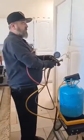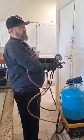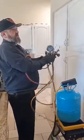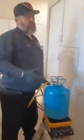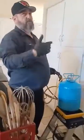And you're done? Pretty much just got to button it up, put seals on the valves that you've just installed, screw in the back panel. And seals like this one? Yes, just like that. You want to cap it off because these are access valves like on a tire. So sometimes they can leak. If you put another cap on, it won't. Well, it still could, but it helps prevent it.